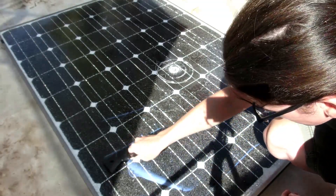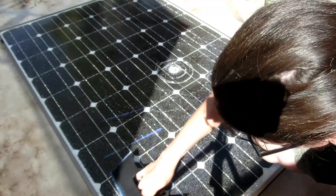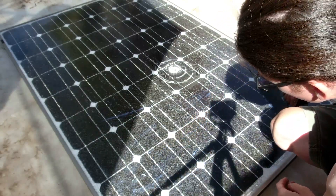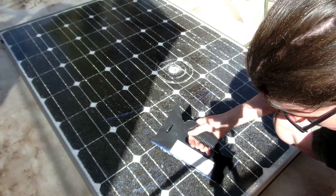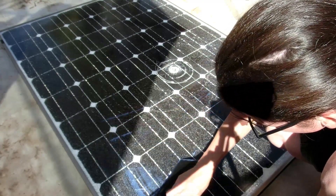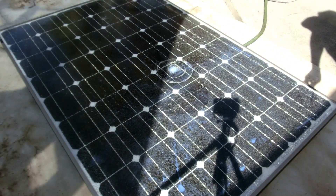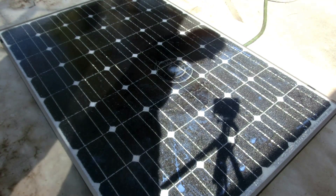It's coming back up too. We can do multiple layers. Oh, that is coming up pretty quickly. The only problem is if we start scraping it up like that it's going to get messed up, because part of it will always be stuck in the cracks. We've probably done this the entirely wrong way. We've made every mistake that was possible to make. I can just call it 'how not to clean or fix solar panels.' Although, call it my imagination, it already looks like it's clearing up a little bit — the whiteness is getting more spotty, not large swaths of whiteness. It's just starting to concentrate in the thicker areas, which is a good sign.